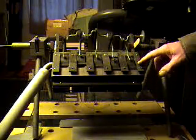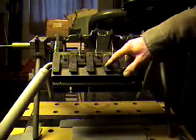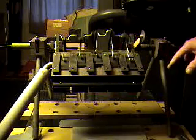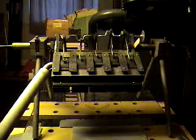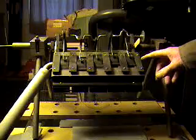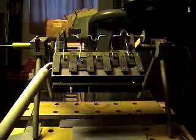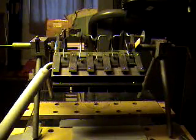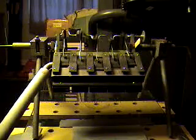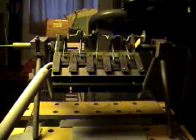One thing that's nice is that there's no perceptible vibration in the motor, which means that all of the valves are all relatively equally tight. If there was one chamber that was working harder than the others, it would come out as a vibration and you would see everything here shaking. The fact that it's not shaking is an indication that the motor is fairly well balanced in terms of its utilization of the vacuum. We'll just let that go for a while.